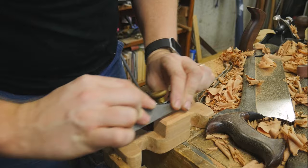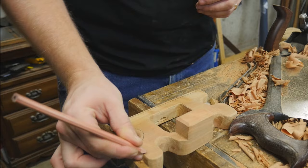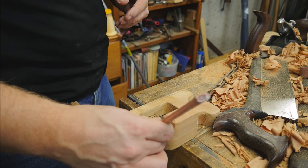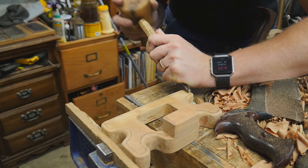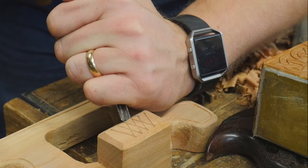For this top piece, I'm actually just going to chamfer it a bit with a block plane, and then I think it's time to do some carving. I want to do a very simple groove running around this — I'm just kind of playing with new designs and feels, and I thought this would be fun. So I'm tracing around with my finger, making a mark all the way around the outside, and then coming in with a V-groove chisel to run around it. It's a very simple, easy project, and in a little bit of time you have this nice little bit of carving on top that makes everything pop out.